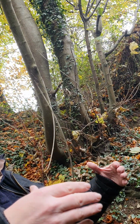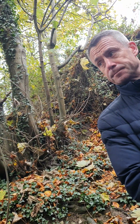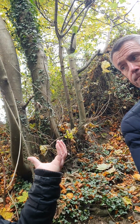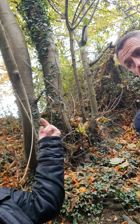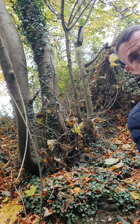You'd have to find out what they are before demolition. Trial holes each side, we'll do that. You'd always trace them and follow them through, dig a trench, expose them before you go down. Then you might have to have some sort of gantry or temporary support to hold it there, or it depends what it is, I suppose. We might be able to reroute something. I don't know. So you do trial holes, well, that's good.